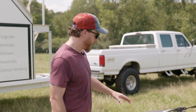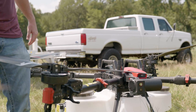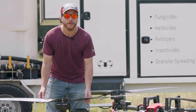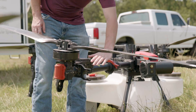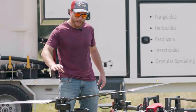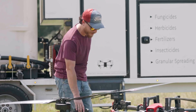We are going to be going over the specs of the XAG P150. Here we have carbon fiber propellers on this teeter hinge for optimal maneuverability. We have these nice sized motors which are capable of 120 pounds of thrust each. These ESCs are conveniently located underneath the propellers so that you get a cooling effect while the drone is flying and you don't get overheating of the ESCs.